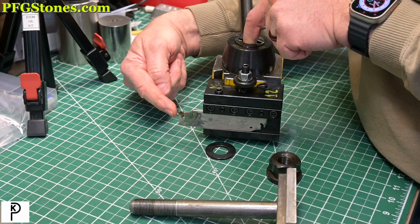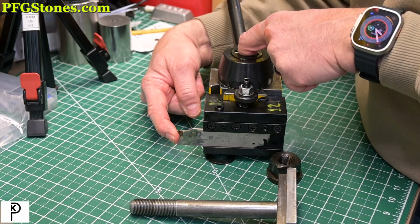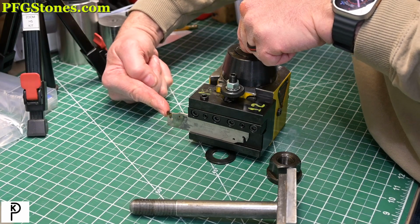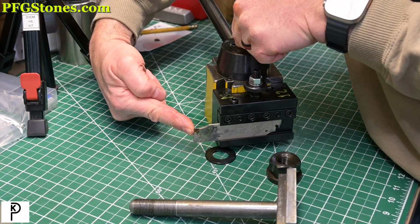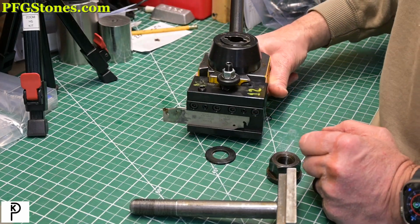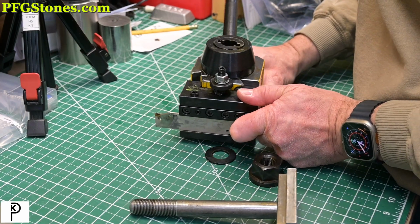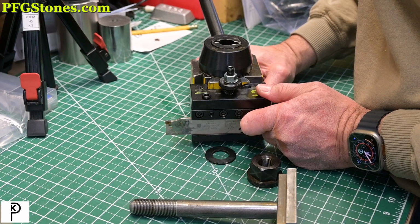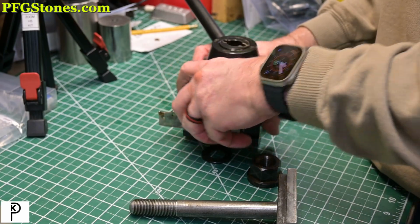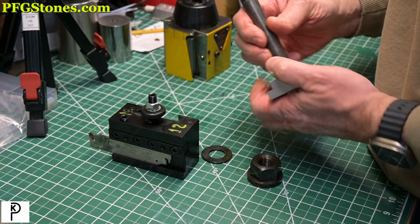Here's an instant replay of that. Ready? This finger is making believe it's the tool post stud, and this finger is making believe it's the cutting pressure. You ready? See the rotation? It really wants to rotate. And I think when I went to look to see if anything had changed, I in fact noticed that the tool post had rotated. Not a lot, but enough to change the game. So we're going to take a look at figuring out how to prevent that rotation.